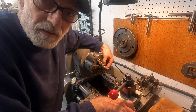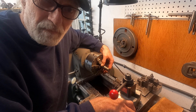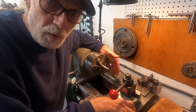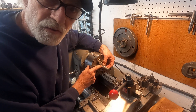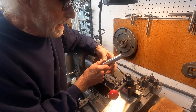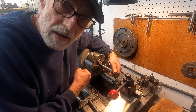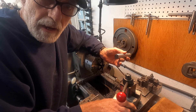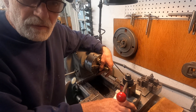Another thing about a six-jaw chuck: you only want to put machined or ground surfaces in it. You don't even want to grip cold-rolled steel — you want to grip turned, ground, polished hydraulic rod, machined bushings, and things like that. Otherwise you'll wear it out, and the jaws drop out one by one. You can test this by putting wet Dykem on the work, let it get tacky, stick it in the chuck, clamp down, and check the impressions to see if jaws are losing contact. Save the six-jaw for the right jobs.